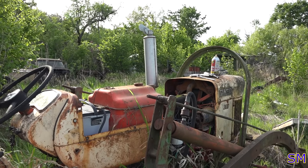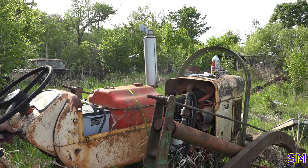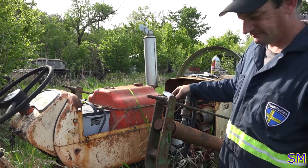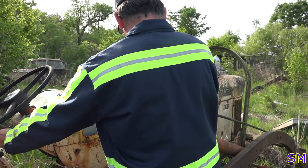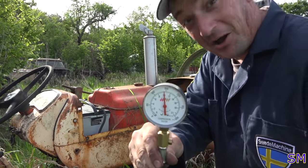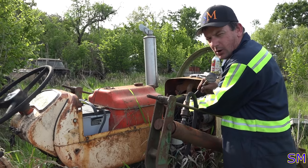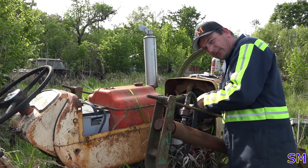Okay. Be the third or fourth time with diesel re-oiling everything. It's spinning nicely. Compression test, number four cylinder. Dang. Number four, 150 PSI. That's a strong cylinder. Of course, this is wet. So, it might go down a little bit, but so far so good. I'll get it to start. Hopefully our other three are somewhat intact.